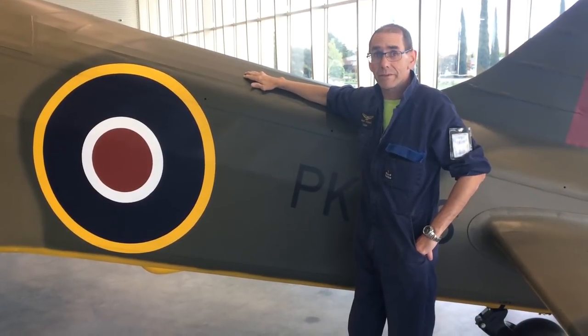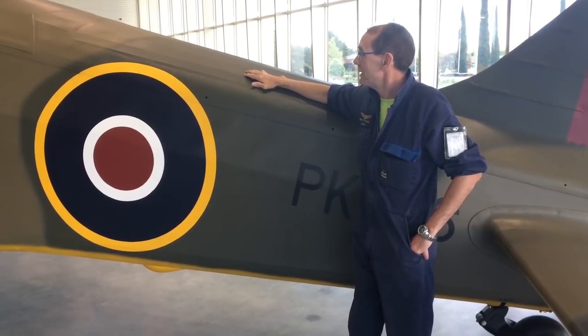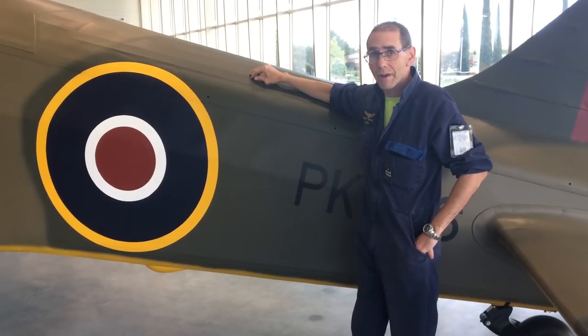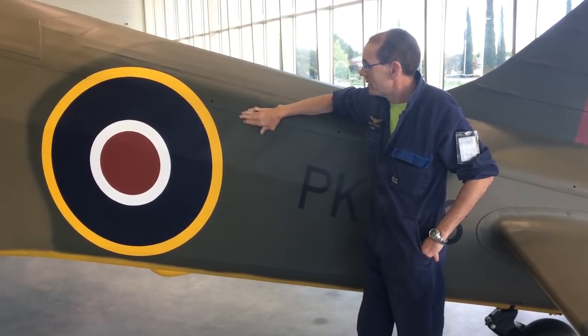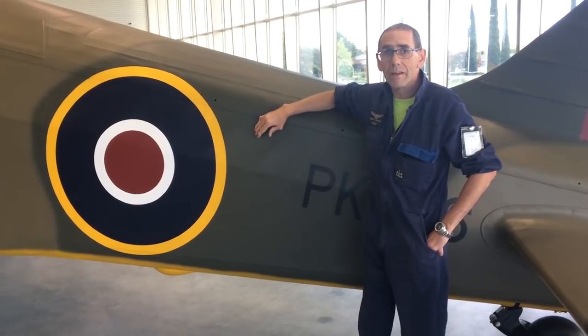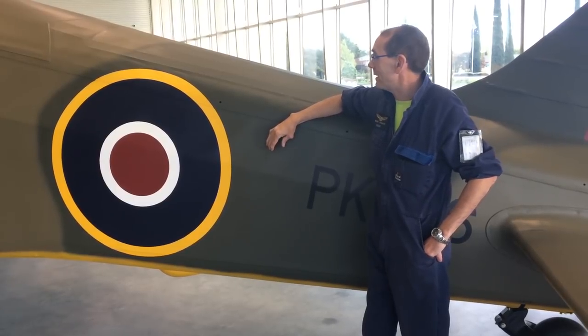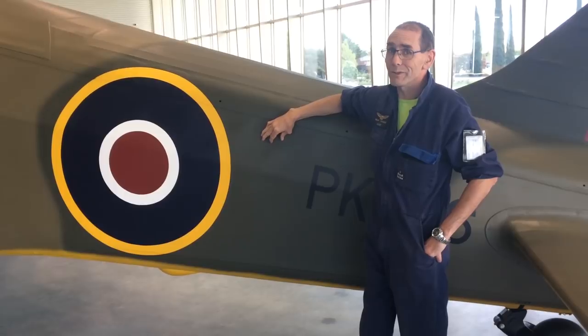That's the basics of our doping story regarding old wooden aircraft. We've got open structure with that nice taut fabric over the top, and our closed wood nicely waterproofed with a layer of dope and fabric. This will last for another hundred years — and hopefully I won't be around to see it recovered, because that's a hell of a job.